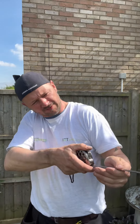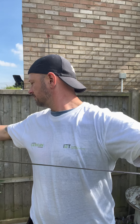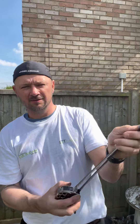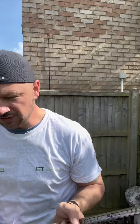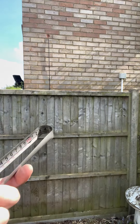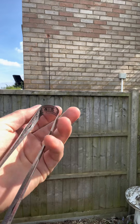When you've got a long measurement and you need to work out the centre — say 230 — rather than think about it, split it in half. Put your tape on 230 and if you look towards the end, it reads 115. That's your centre.